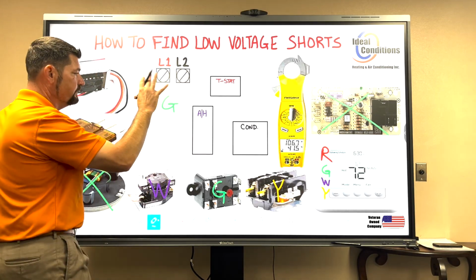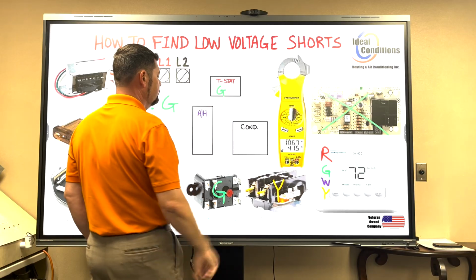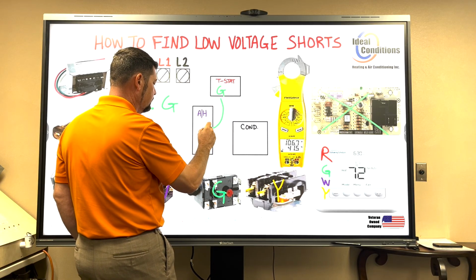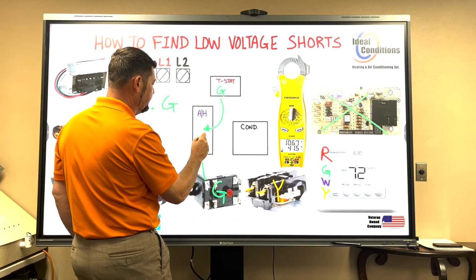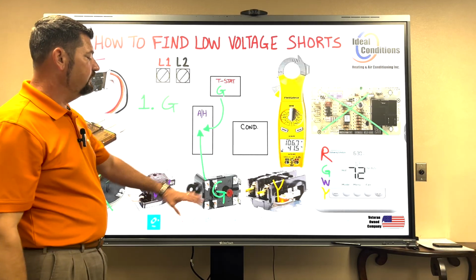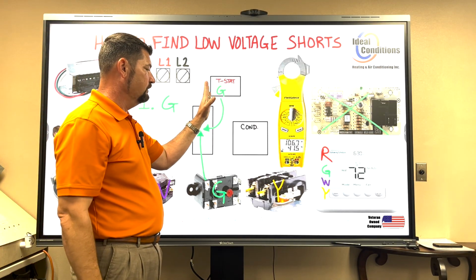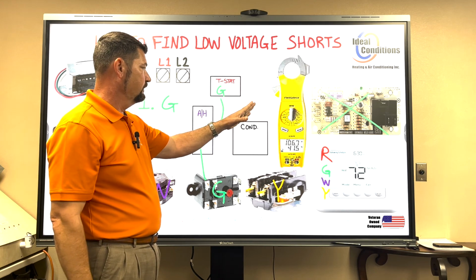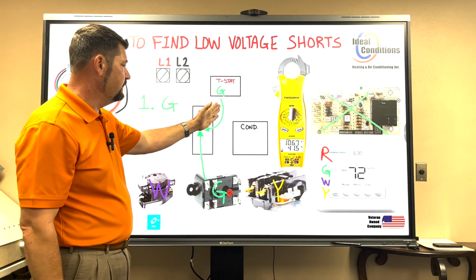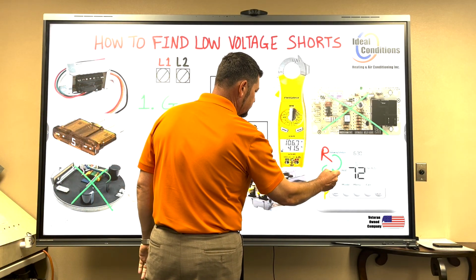If I go to my thermostat and I say I only want to run my fan in the on position, well, we know that the path of electricity comes back to my air handler, and we know that this blower relay is located inside this air handler. Now, by putting the fan in the on position and the system in off, the path of electricity will only send power from R to G, right? Basically, we'll be connected here.